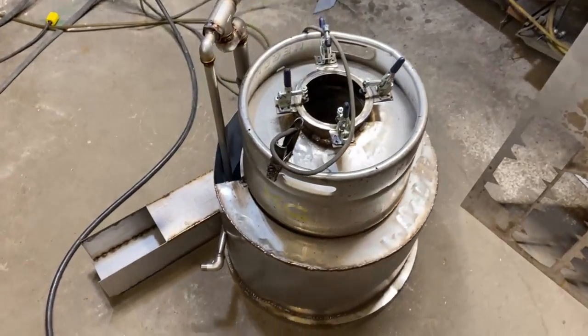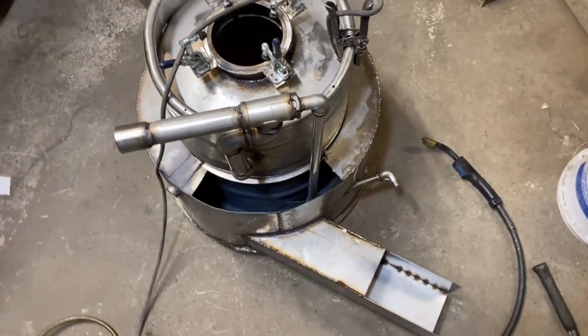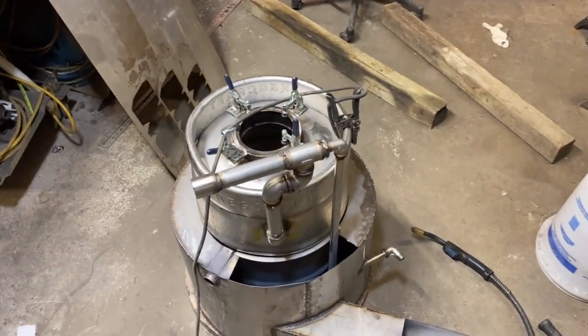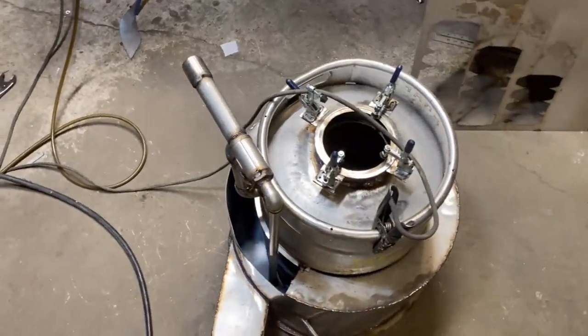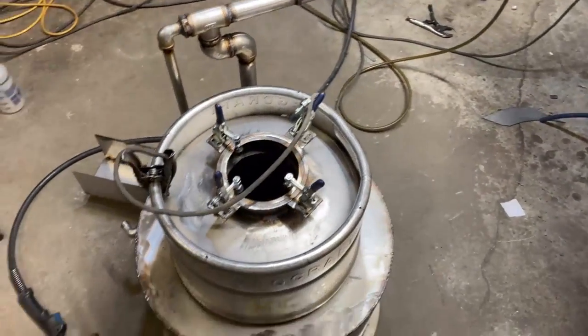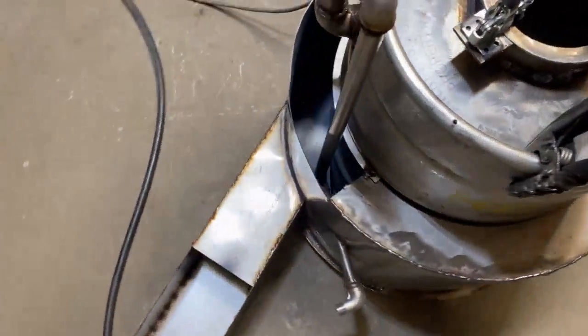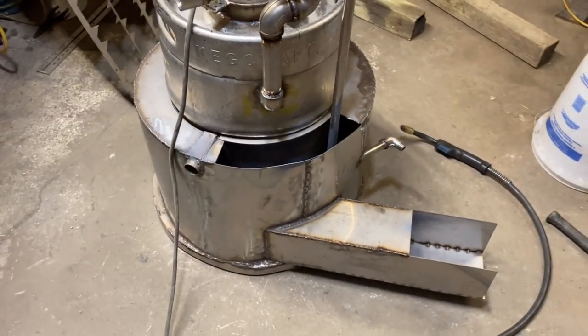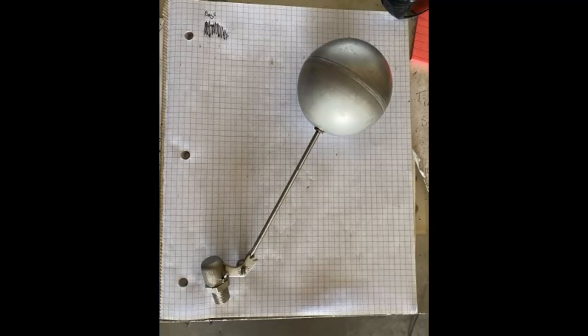What we're looking at here is an organic weed control boiler that I'm building. It has a super heater on it to bring the steam up to about 300 degrees, and an air augmentation blower hookup configured in a Venturi setup so that it holds a slight vacuum. We're going to be hooking a float valve up to this so the water level stays continuous and we don't burn up the boiler — we can't scald the sides of this tank. That float valve is essential to making this work so you don't have to stop and keep filling it up.